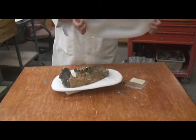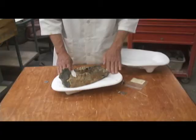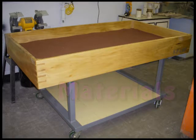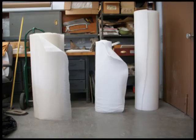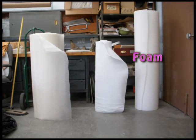It is made in two halves like a clamshell with a padded interior to protect the surface of the fossil. The materials used are a deep sandbox with garnet sand preferably, Hydrocal FGR95 dental plaster, fiberglass, polyester felt, and polyethylene foam.